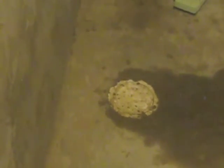Then I've got to put T-junctions in the hot and cold water at the bottom of the boiler there, and take that across to the taps, which will then be attached for the bath going there. That's the bath drain there. So in Sweden, the bath just goes directly into a drain in the floor like that, and that's the shower drain there.